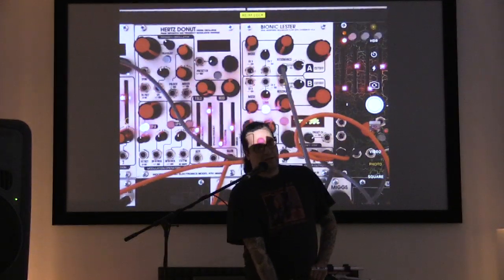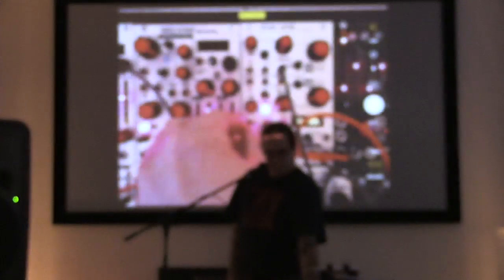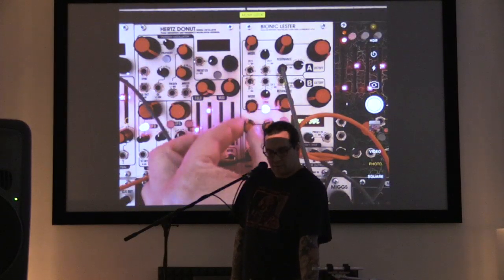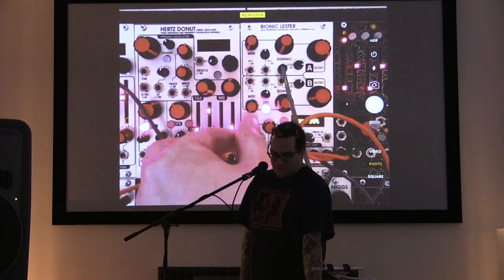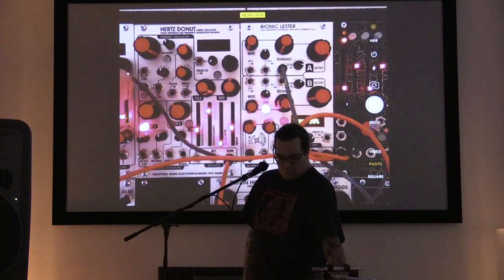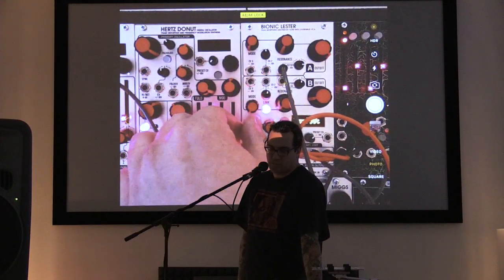You can hear the small jumps in amplitude as I morph from wave to wave, and that becomes more important when the overdrive is in play. With the gain control at 0, going up to noon, it simply acts as a gain control. But if you go beyond that, soft clipping comes into play. And beyond that, the clipping becomes harder.